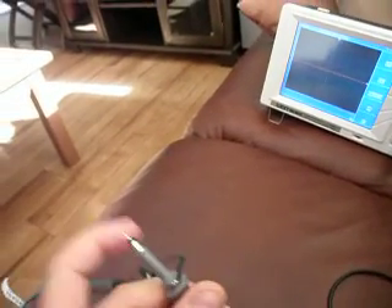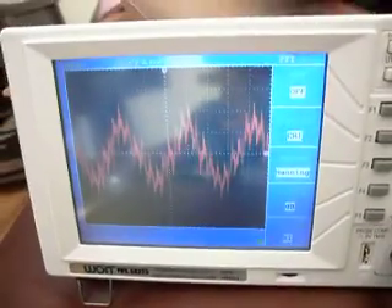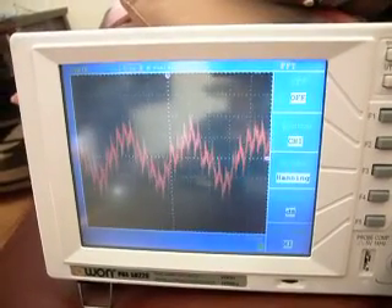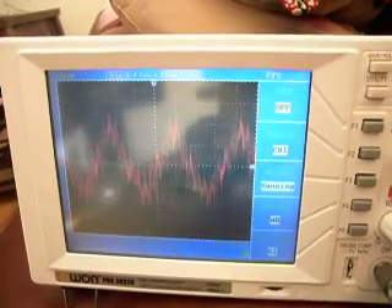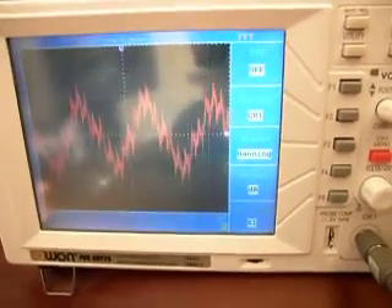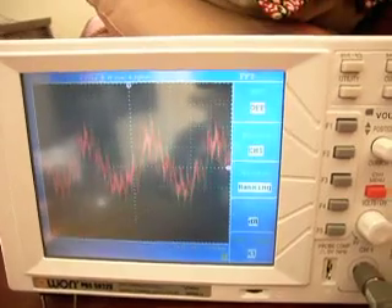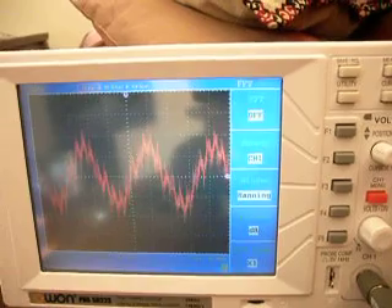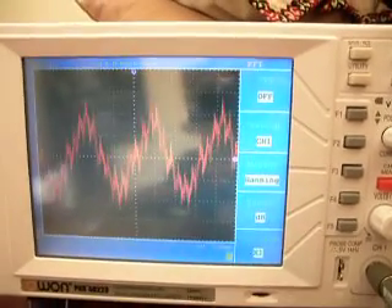To read the body voltage, we simply connect in with the tip of my finger. And there it is. Most of this voltage is actually coming from the cables behind me, but you'll see it's varying quite a bit — and it's actually the television that's causing that feature of cathode ray tube televisions. That voltage is about 200 to 300 millivolts peak to peak. Each one of those squares in the vertical direction is actually 50 millivolts, so you can see we've got quite a few squares that have the waveform in it.